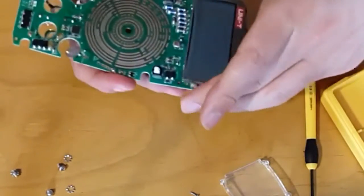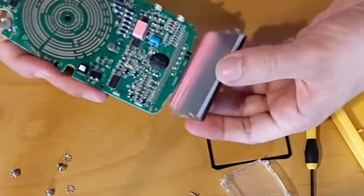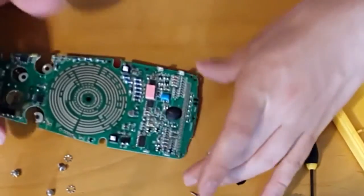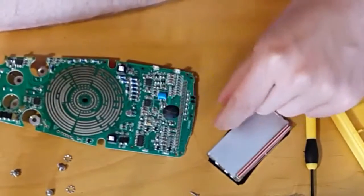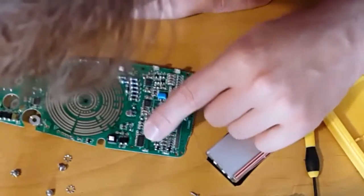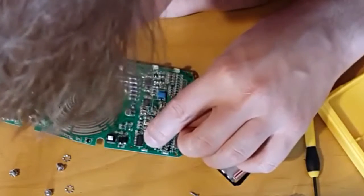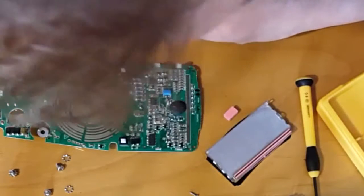Clearly all the really interesting stuff is going on under here. Let's see if I can get that off. Just enough to see. It's one of them — so that just goes onto there. We've got some lovely blob chip-on-board controller. A bit of phone here. That chip on board is obviously going directly to the display. Obviously these are going to be various input stages. Now that one there — there's slightly chunkier traces coming out of that.